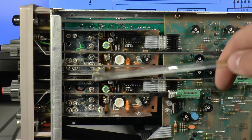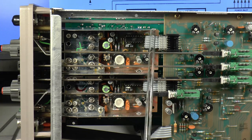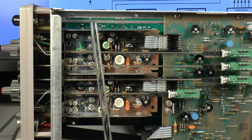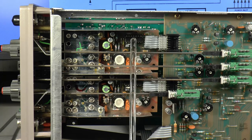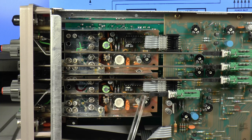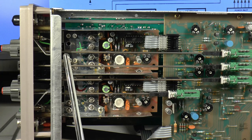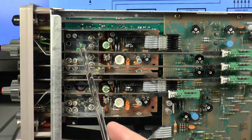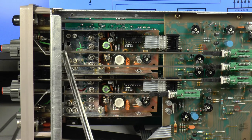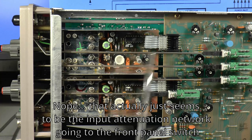To figure that out we want to look at the output signal from the front end. We switch the oscilloscope off and take a close look at the front ends — this thing here is channel two, this one is channel one. These things are almost entirely discrete except for these ICs in here — these are UA733 chips. Looking at the date code: 23rd week of 1982, which is almost exactly 40 years ago. We also have some adjustments I don't want to touch yet, and there's a shielded part in the front with some free-form circuitry which will be the high-frequency amplifier part.